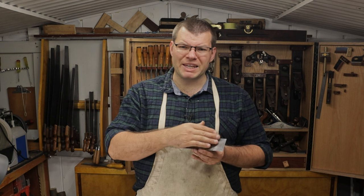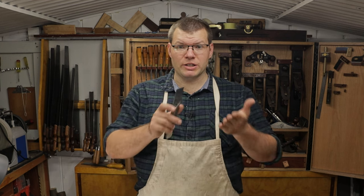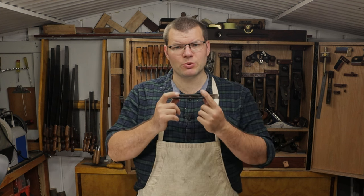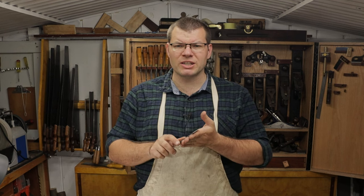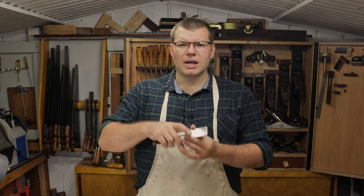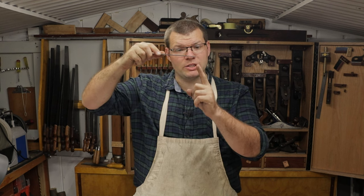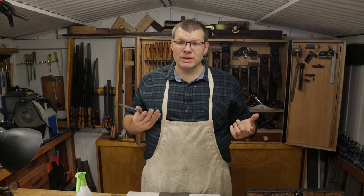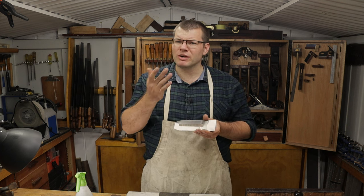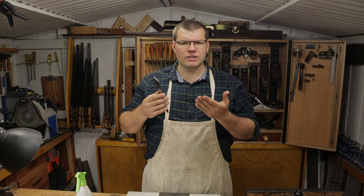The other thing you can have is sometimes they have a little belly in them and that could take ages to flatten, just like the twists in them. I personally try to flatten the back of a blade all the way across because I find it actually works better and it's easier for mating the chip breaker against the back of the blade. But when you do have situations where you've got twists, it's going to take ages and you're going to remove too much steel from the back of the blade to get a nice flat surface for the chip breaker. That's when the ruler trick comes in — with that elevation on one side, it drops the front down closer, meaning you're only sharpening right on the very edge of the blade, which is the first five millimetres or even one to 1.5 millimetres where the chip breaker needs to mate.